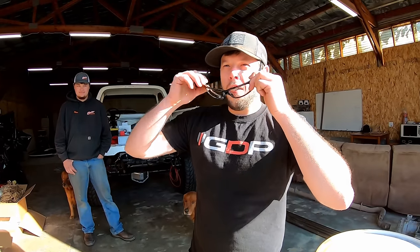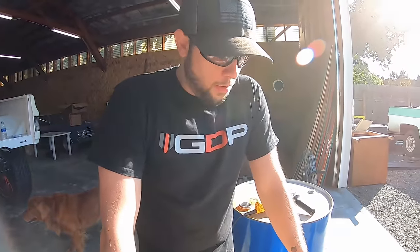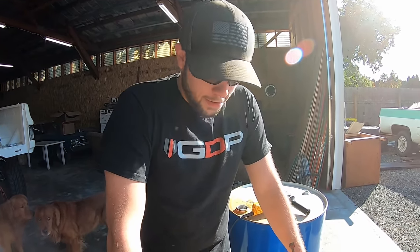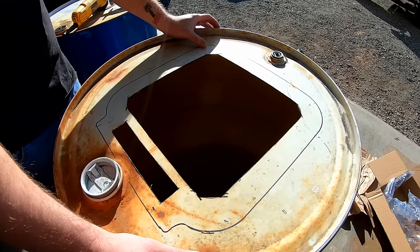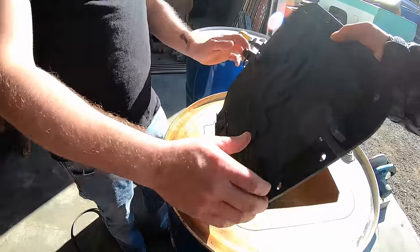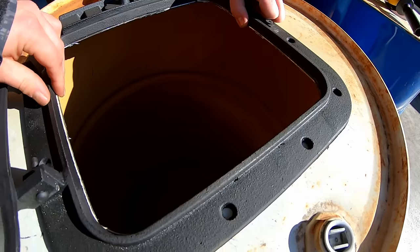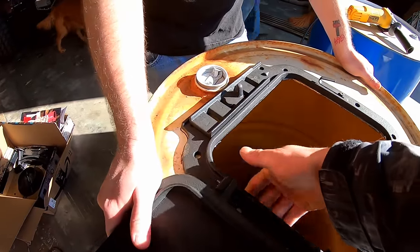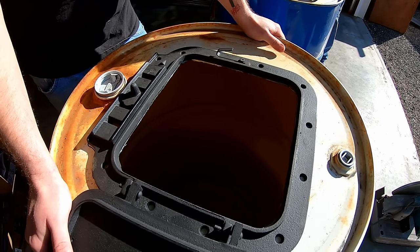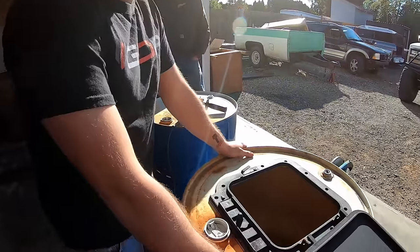Those are some sweet safety glasses — safety first! Remember kids, always wear your safety glasses. Can't do nothing with no eyes. I'm a firm believer — I've seen too many discs blowing apart in people's faces. So we got this cut out: we got our main hole and our vent hole done. How's it fit? That's pretty good. Now we just need to mark the holes, do a little more cleanup on the edges so we don't cut ourselves later, then we'll use an eighth-inch drill bit, drill our holes, and bolt this up.